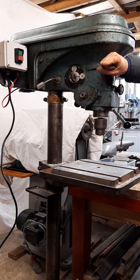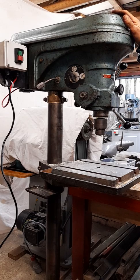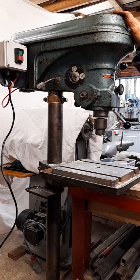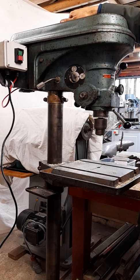The head — it's not a geared head by the way, it's entirely pulley driven, belt driven. I'll have a look at that in a bit. The head is, I think, cast iron construction, as is the base as well. So with all that mass there, it makes for a very substantial, vibration-free machine.